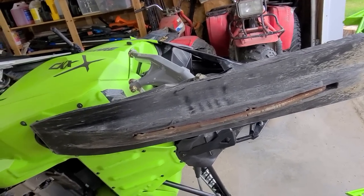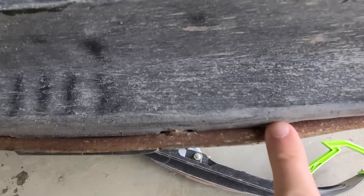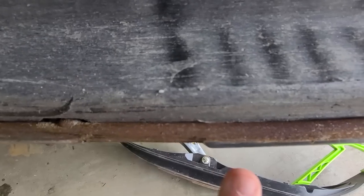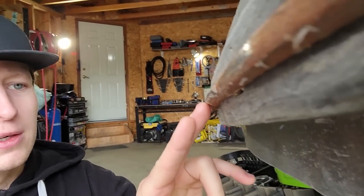With the Hardcore tipped on its side, here's what a good set of wear bars looks like. Let's clarify: carbide versus skag — carbide is hardened metal, skag is regular steel. If the carbide is a little rounded or flat, that's okay. If it's gone but the wear bar has life left in it and isn't worn really flat, that's also fine. A lot of rental industry operators remove carbide skags and put on regular ones — they're easier on decks. As long as the wear bar has life left, there's nothing wrong with that.